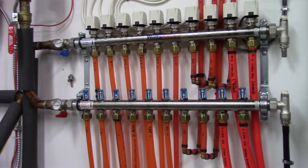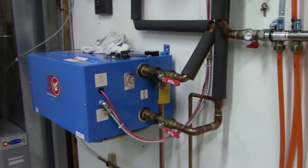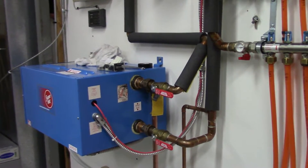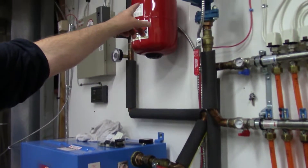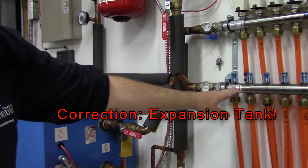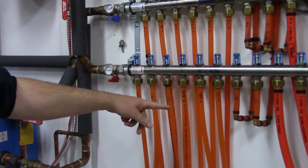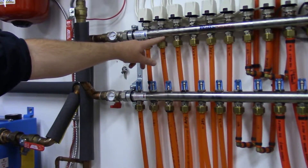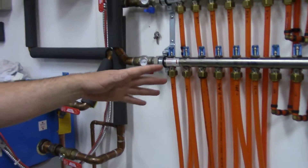This system I put in myself when we built our house about 12 years ago. You've basically got a boiler — in this case it's an electric boiler — you've got an outlet line from the boiler, a pressure tank, a recirculating pump, and then it goes down to feed the supply end of the manifold, goes through the loop of pipe wherever it goes, and then comes back up to the return line of the manifold and back down into the boiler to be reheated and just keep circulating over and over again.